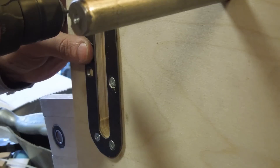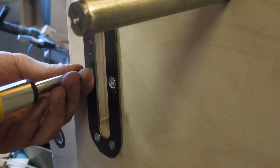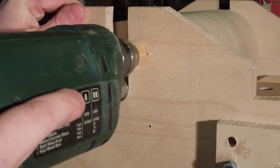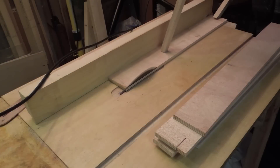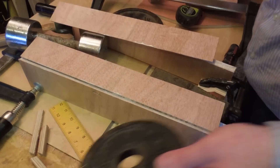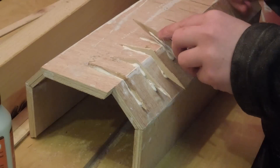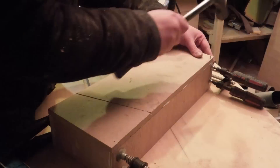I get a lot of questions about why I don't use an electric screwdriver, and this is my answer. Then after checking the table square to the sides and with the drum resting on the table, I screwed in the bearing flanges. And then made the dust shroud using spines to strengthen it. I also made a quick belt guard.